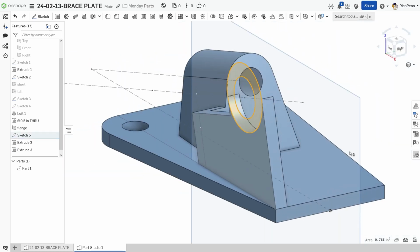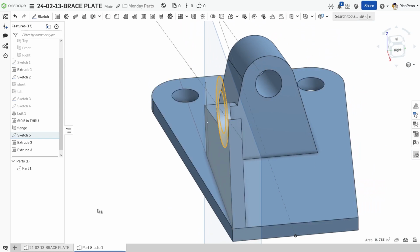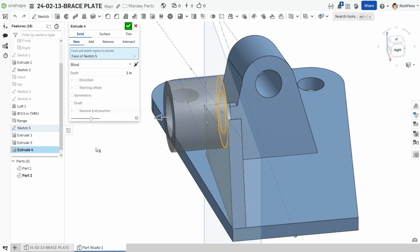Now this is more interesting because it sticks out, but the amount it sticks out is not apparent to the average user. It's hidden. So the way we're going to determine it, the blueprint says outside to outside is 2.5 inches. Let me put this in parentheses, 2.5, but the outside to outside of the existing walls is 2.375. And we're going to divide that number by 2, and that should be the amount it should be sticking out.